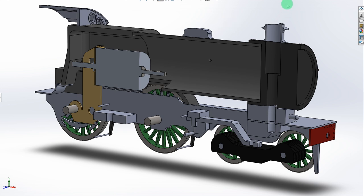The idea is that a bolt will be able to pass down through the chimney and fasten the smoke box to this stretcher block, which will have a tapped thread so the bolt holds the front end of the boiler and smoke box assembly firmly in place. Alternatively, I may bring a bolt up from underneath — the advantage being that the smoke box could then be completely open, enabling me to put a DCC chip inside.